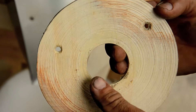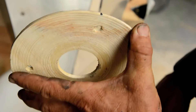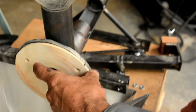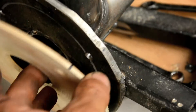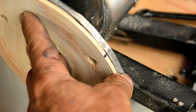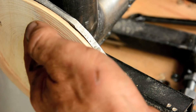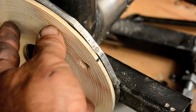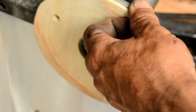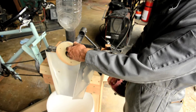Once you square it, it's very important that you know it's reinstalled exactly the same way each time, so we put a little indexing mark on both the stator plate and the squaring gasket. That gets your mill nice and square, so that when you run the mill, the gap between the runner — whether it's a burr for grinding flour or a rubber pad for de-hulling — runs nice and square and the gap stays even.